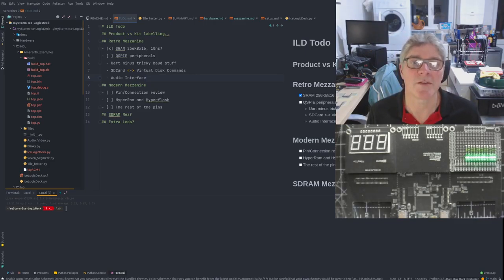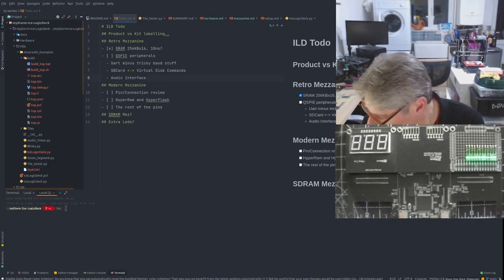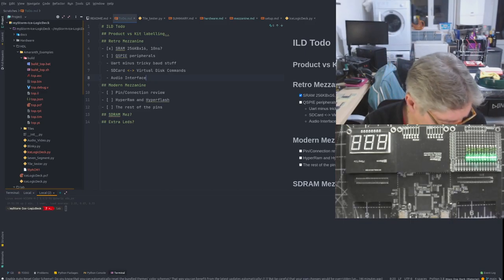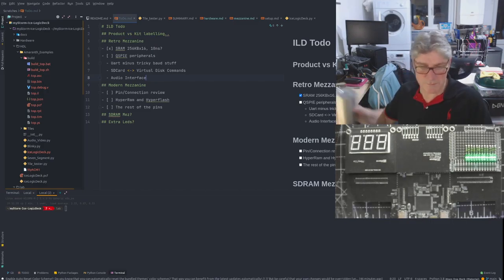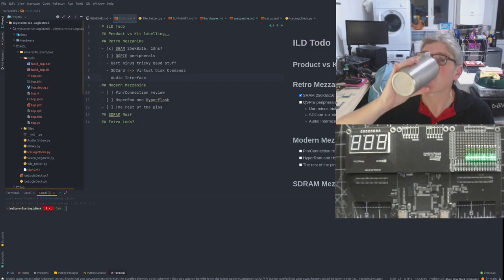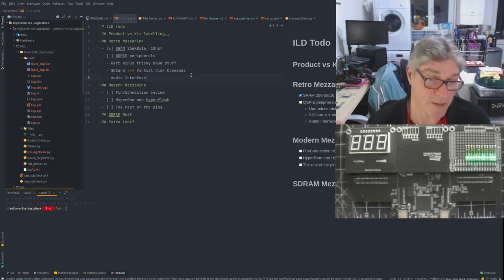Anything else that would go over QSPI? What do we got? So, UART, SD card, audio interface. So, disk interface, audio interface, and UART. I think most other things would probably be better off handled directly by the FPGA using tiles. Obviously VGA, HDMI, that kind of stuff, that's just a tile. Or an LCD display, that's another tile.